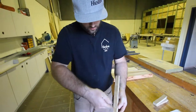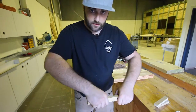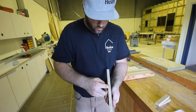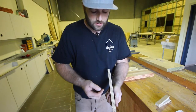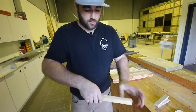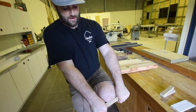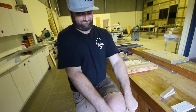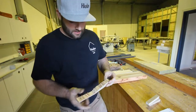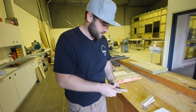Now the plywood — the grain is going this way on the two outside layers, so there'll be slightly less strength in this direction. There are one, two, three layers going this way and four layers going the other way grain-wise, so it's a little weaker than it normally would be in this orientation. But anyway — can't break it with bare hands, and with the knee it's quite a lot stronger. I hurt my knee there. So — a lot stronger, better in the wet, and also a little bit lighter, which is a bonus.